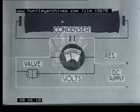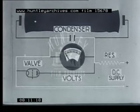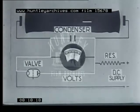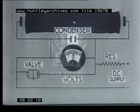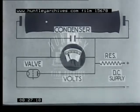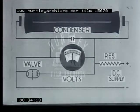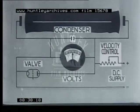Returning to our diagram of the simple time base circuit, it is apparent that we will want to vary the velocity of the spot across the tube face — that is, the rate of buildup of the voltage across the condenser. This is dependent upon two factors in the circuit: the capacity of the condenser and the resistance through which it is charged. So we obtain various fixed time base speeds by switching in various condensers, and allow for final adjustment of the spot velocity by using a variable resistance, which is known as the velocity control.